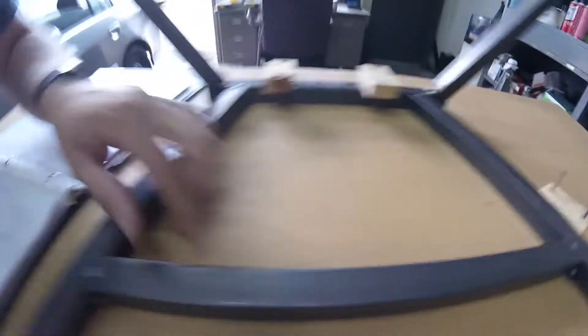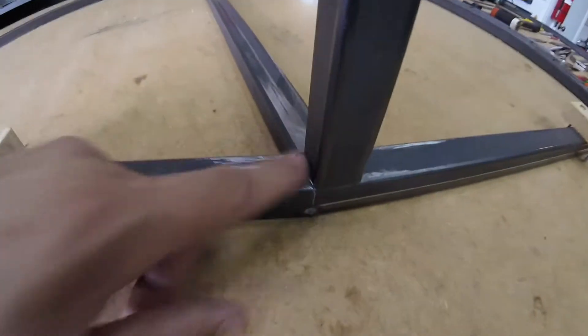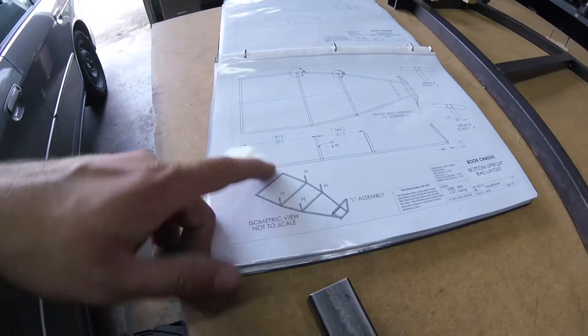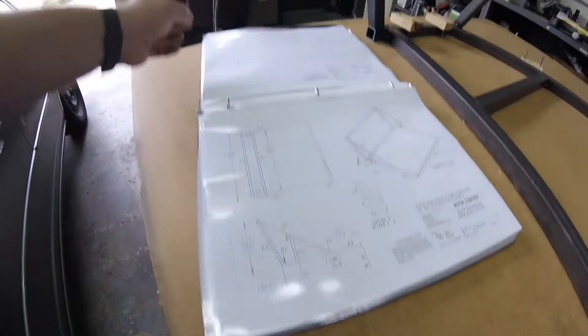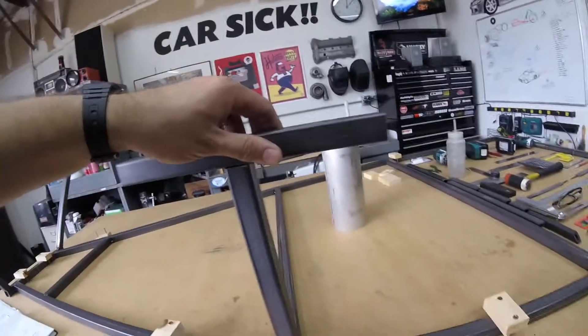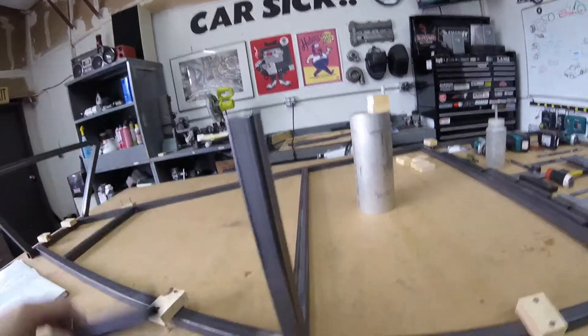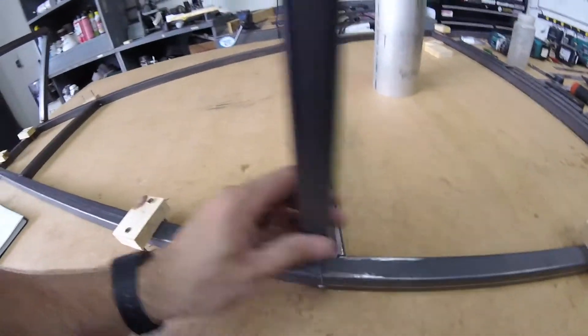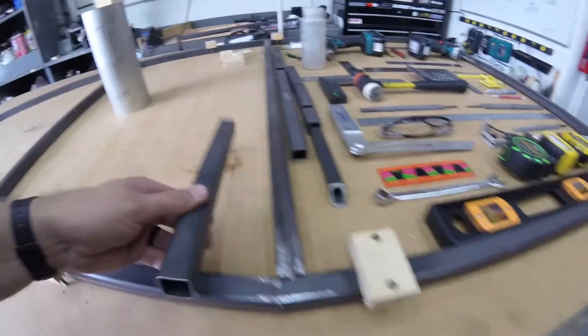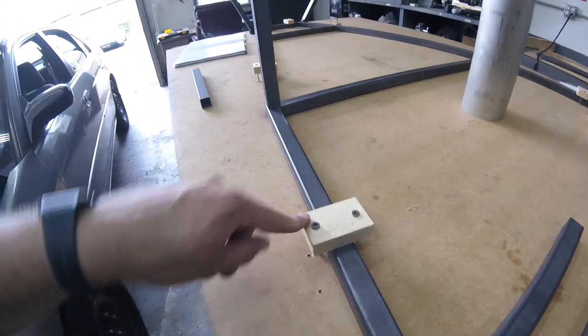I got all this tacked together, and you can see the bandsaw makes a very nice cut — gets my angles just right. Right now I'm working on my H-tubes. They are 11 inches long with an inch down here and an inch tube up here, which makes it 13 inches high on the side. Any taller than that and I think it looks goofy.